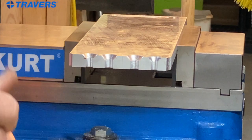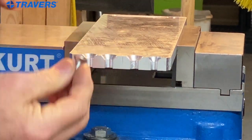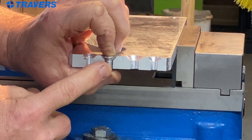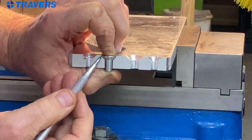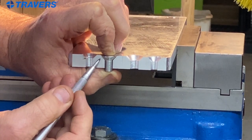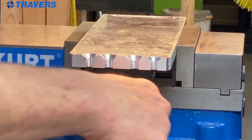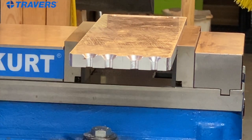So what's the big deal? It's only eight degrees — what's the difference? The difference is when you put a metric screw in an 82 degree countersink, it's going to come loose because you only have a very small area where the head is in contact with the work piece. Over time, it's going to very easily come loose. So it's pretty important to use the right countersink if you don't want your screws to come loose.